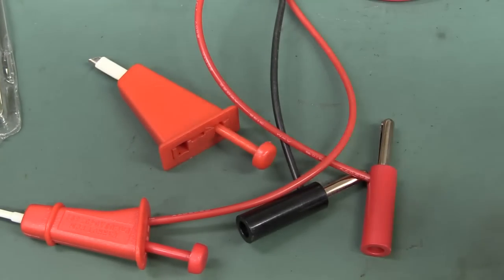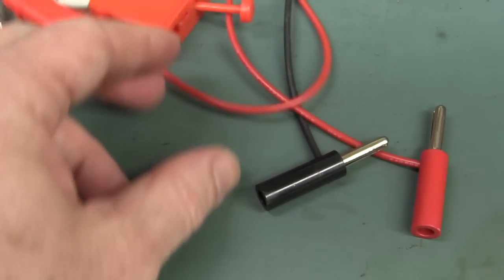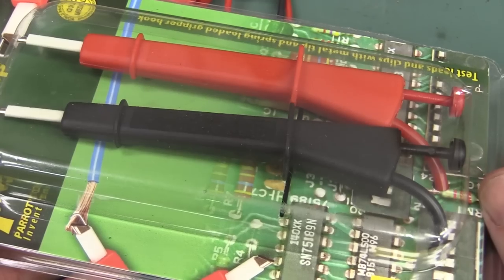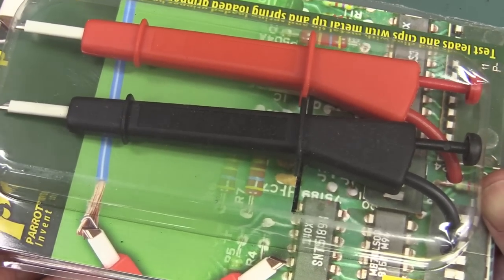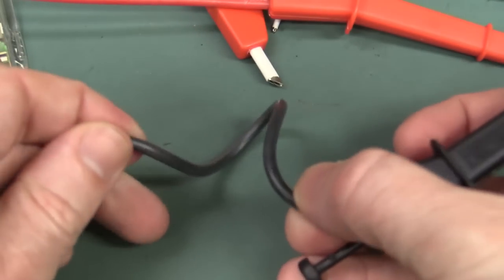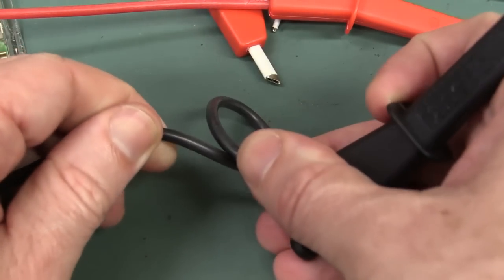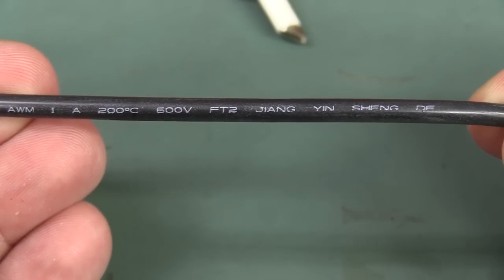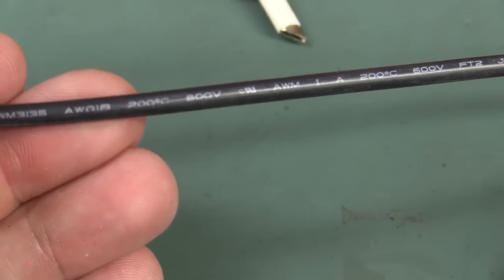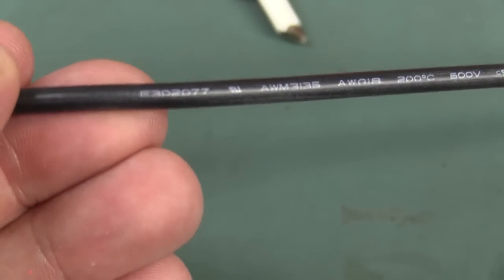So if I was doing IC pins, I think I'd rather have the easy hook. But the problem with easy hooks is they don't come with nice attachments that you can then plug into your multimeter, whereas this comes with all sorts of things - piggyback-style banana plugs, shrouded ones, binding post clips. These are just bigger and more robust. And check out the finger guards on these. So if you're probing decent voltage stuff, you don't want to be dicking around with an alligator clip - these are much safer. They come with really nice silicone leads - just beautifully flexible, just like proper multimeter leads. Awesome. Jiang Ying Xing - 600 volt, 10 amp, CAT 3. Suitably rated.